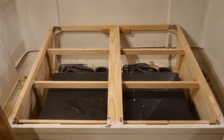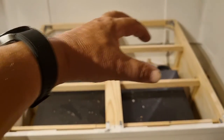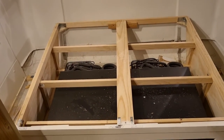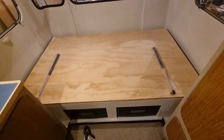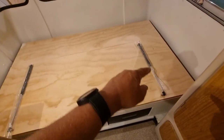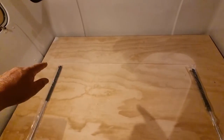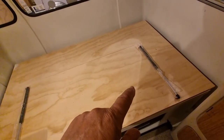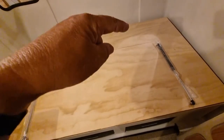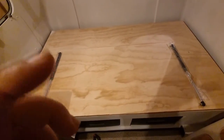The first thing I'm going to do here is just put some battens in through here on both sides, so that when the sheets of ply are lying this way they don't end up sagging down in between. So I'll put a couple through here and make a start on that. There's the base of the bed now made up. This first section I'm going to eventually put the struts in, and it'll be hinged back to about this part here. Next step is to make some markings, draw some ventilation holes across the bed base, and put a trim along the front here.